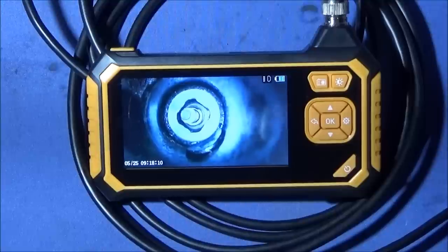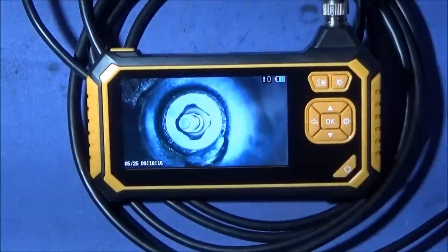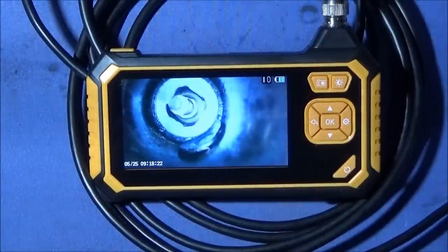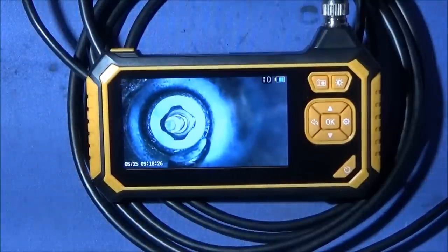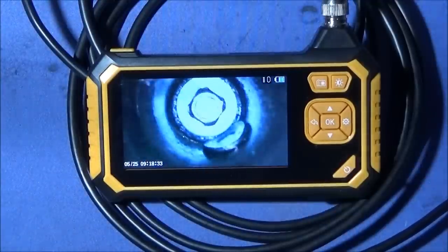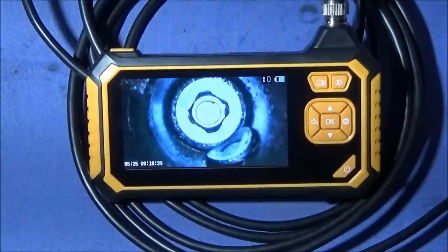The centre part there is the actual valve, the brass piece. And the striker's on the end there, which the hammer hits to knock the valve forward and open it. The square section with the corners taken off, that's the actual nut that holds the valve assembly in. And now I've got to take that one out, and that one unscrews.